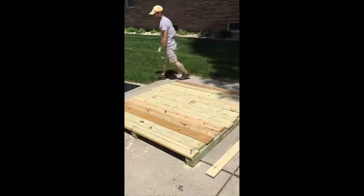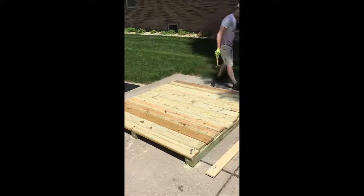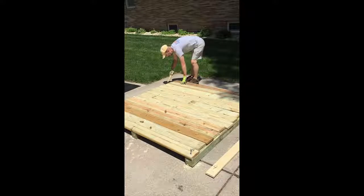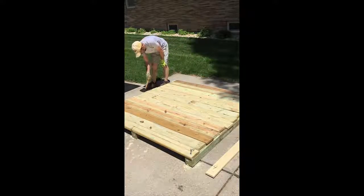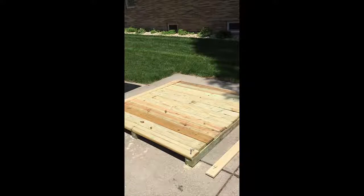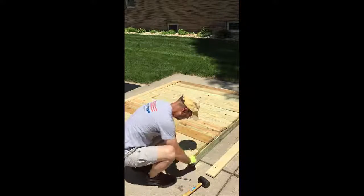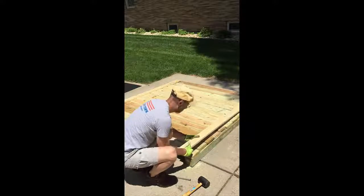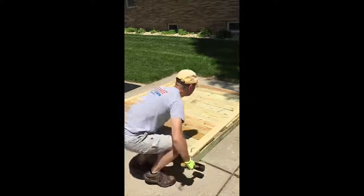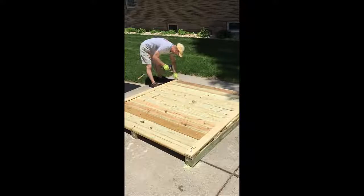With the stage floor in place, I used the rubber mallet to get the boards as close together and as even on the ends as I can. Now I take out the bolts, place the 1x4s over the top, and replace the bolts at the end of the stage where I drilled through the 1x4 earlier. Making sure things are as tight and even as I can, I drill the last 2 holes in the other end and put in my last 2 bolts.